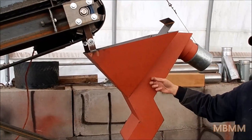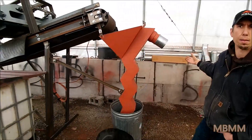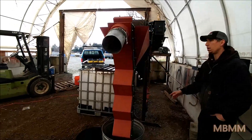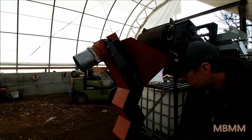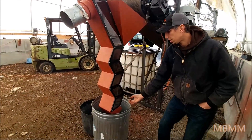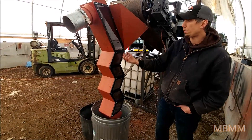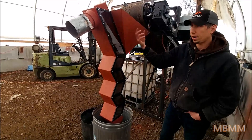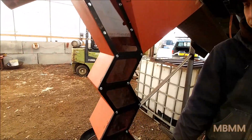This is one of our zigzag separators. We do not have the air classifying system set up, so this is just going to be a chute for today. But the way this works is when the air is hooked up, you pull a vacuum up from the bottom — the heavy material comes through across the airflow up, and it carries the light paper, light plastic, string, and fluff up into the sucker, while the heavier dense metals come down through the bottom.